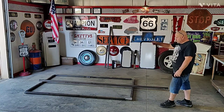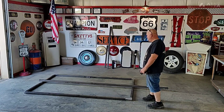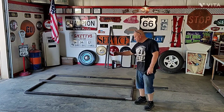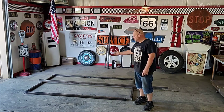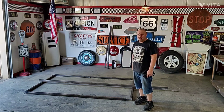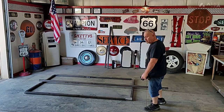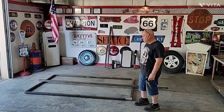My draw bar lays on top of my three rails. There will be another rail in the center there. I put my center rail exactly 4 foot. It's an 8 foot trailer, so I split it in half. My two pieces of plywood will lay right on top of that seam, a place to bolt them down. Also, it's hard to get water in a step seam like that.